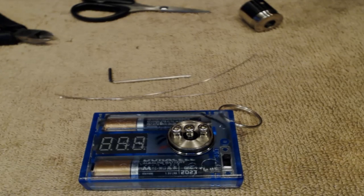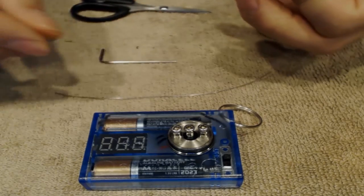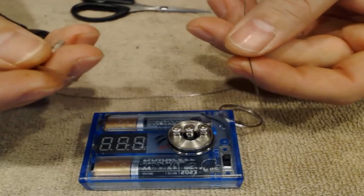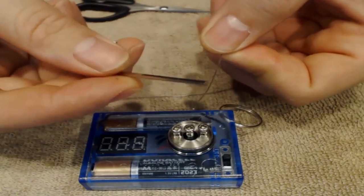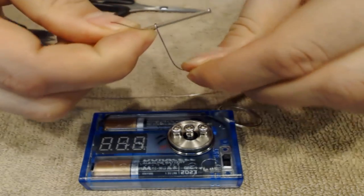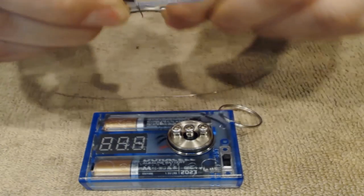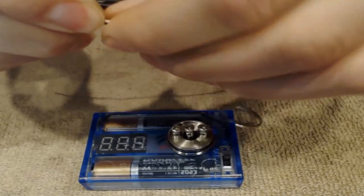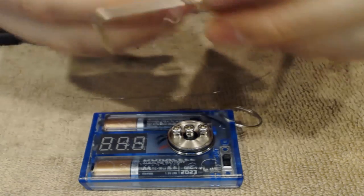Welcome to build mode. Let's go ahead and get started on an easy simple dual center post build. First things first — I have a 5/64 allen wrench which is what I normally use when building these coils. We're going to do five wraps, doing them as close as you can just to make it a little easier. One, two, three, four, and five — there we go, we got our first five wraps.